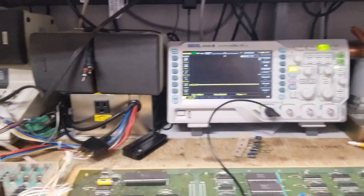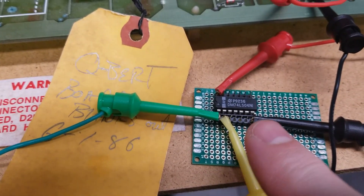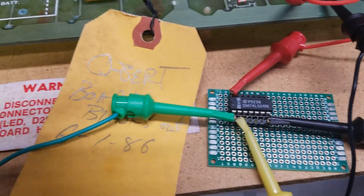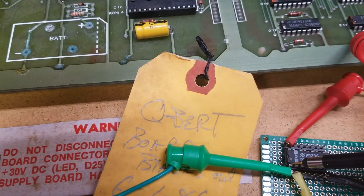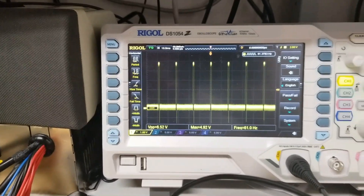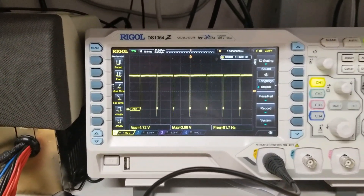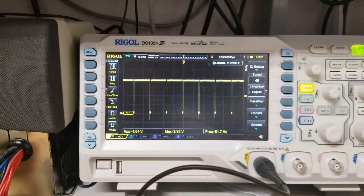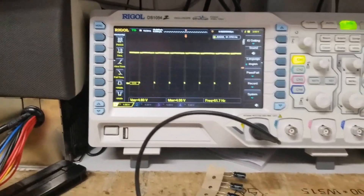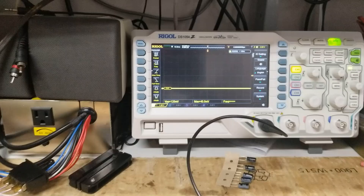The signal is going negative, possibly due to capacitors on that line or interference. I disconnected my video connector because the extension cable from Bob Roberts is putting noise on the signal. I want to show what the horizontal and vertical positive sync looks like coming off the 7407 at J14. That chip is an open-collector high-voltage buffer — it takes the input pin and buffers it to the output pin, then it goes through the filter board.